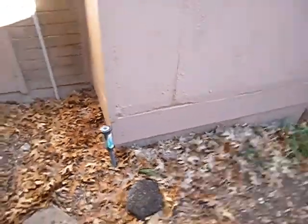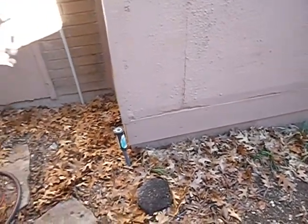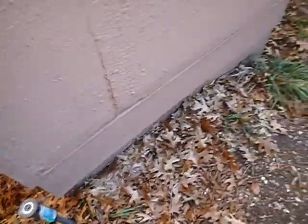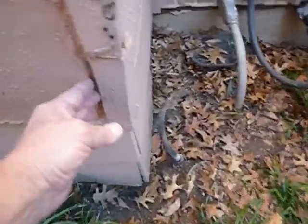This stuff would just melt — that's highly conducive to wood-destroying insects. A lawn sprinkler head should not be closer than 12 inches to the wall. You see we've got a little bit of wood repair here, look at that.